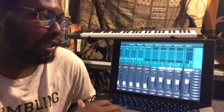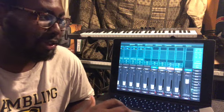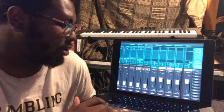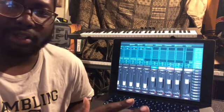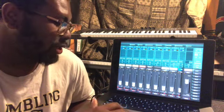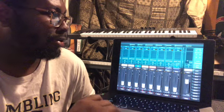And then at the end right here, in this little channel selector series, you can select which channel fader you want, your main master faders over here. Oh, but we're going to stay at main for right now. Also, here's your solo clear, so say all these solos are on, you can just click right here and it clears all of them out. If you need to go find something real quick, that helps. You have your mute groups right here. If I mute group one, that's the vocals. I'll mute group two, that's the instruments. If I mute group three, that's the drums. Four doesn't have a group yet.